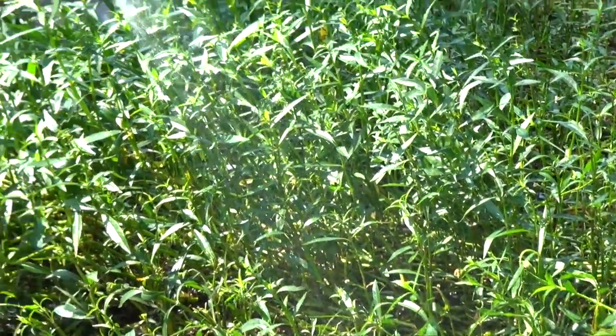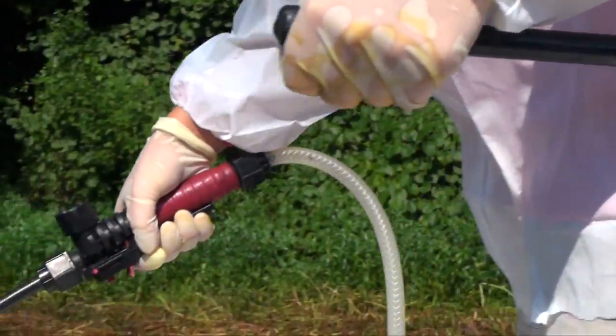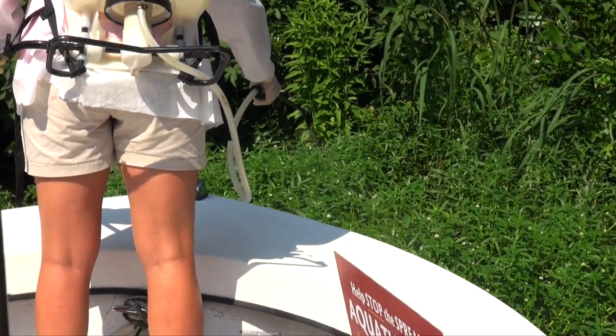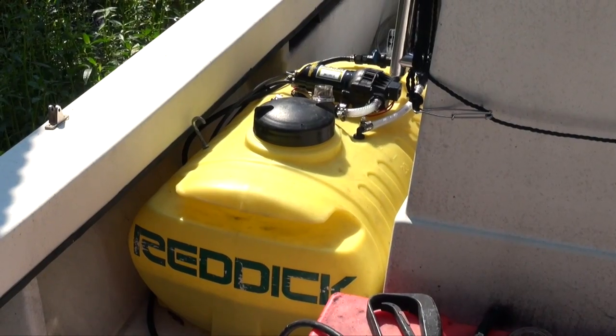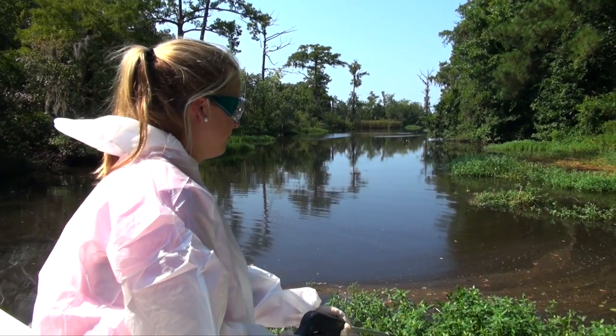If the wind is 10 mph or higher, we won't spray. Another requirement is 48 hours of dryness — it cannot rain the day we're spraying or the day after, because the surfactant causes the herbicide to cling to the leaves. Rain will eventually break that down and cause it to fall off the plants and into the surrounding water, which could kill some of our invertebrates, phytoplankton, or seagrasses on the bottom. We're here to do more good than harm. This is our 25-gallon sprayer loaded with a mixture of rodeo and surfactant.